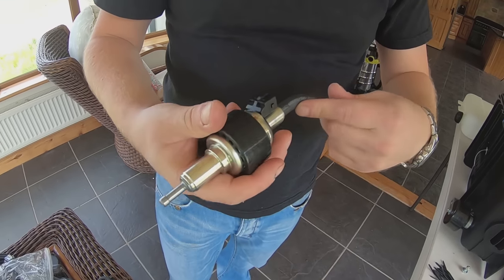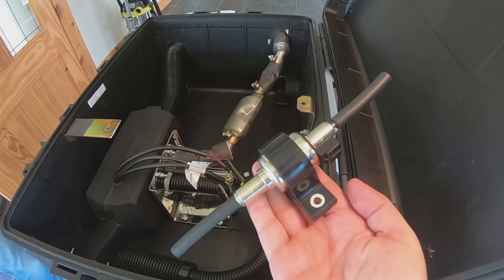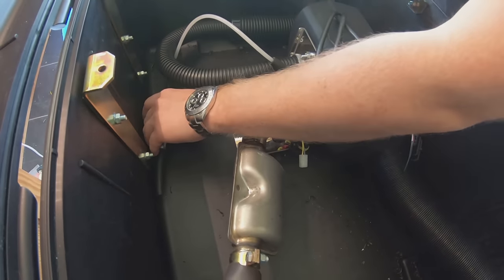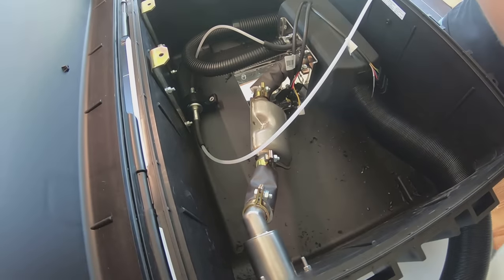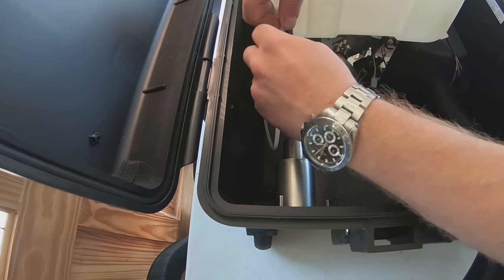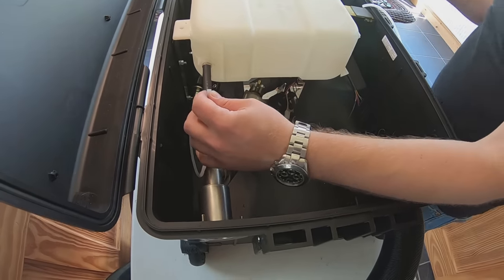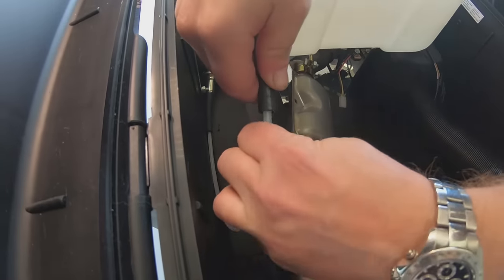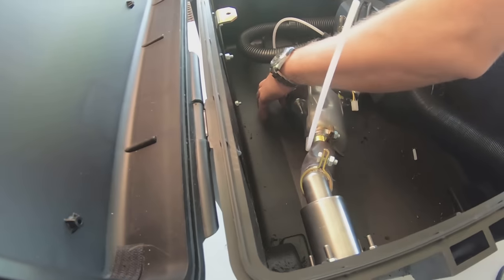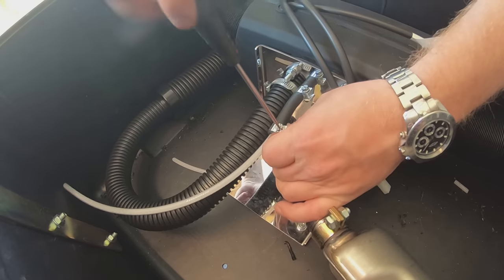So we're looking at the fuel pump. You can see the vibration mount — when that's attached to the case, it'll reduce the vibration because it does make a clicking sound. Now attaching the fuel lines — they're very, very simple and straightforward. At this point we're just working out how long they have to be so that they can reach without burning against the hot exhaust, because the muffler being inside will produce quite a lot of heat. These clamps, which hold the rubber around the fuel lines, are very important to get tight and secure — the last thing you want is for it to be leaking diesel into the case.